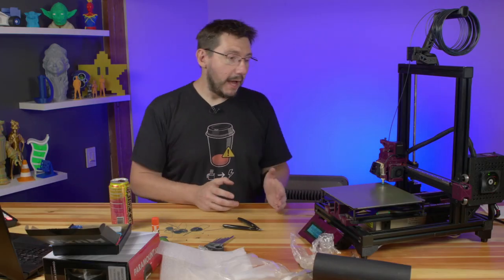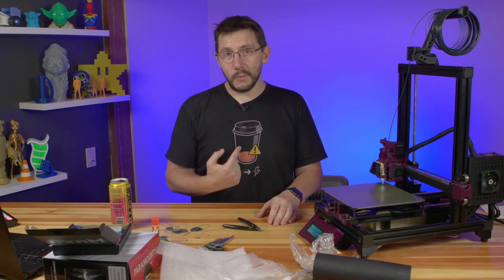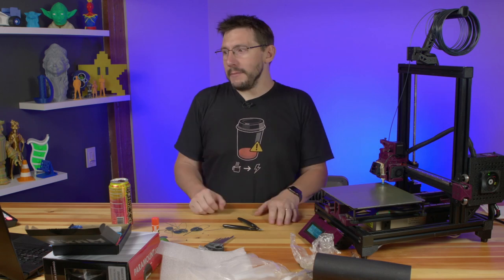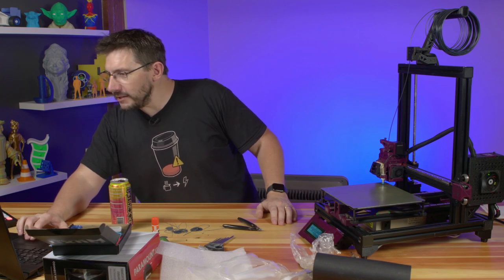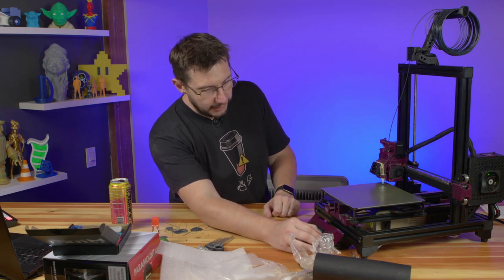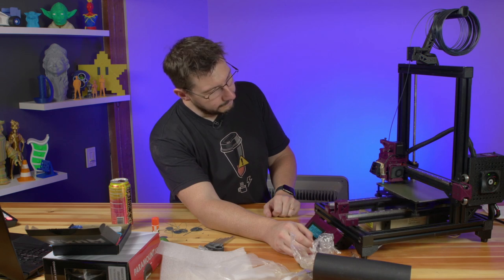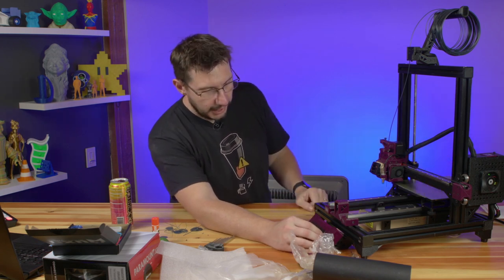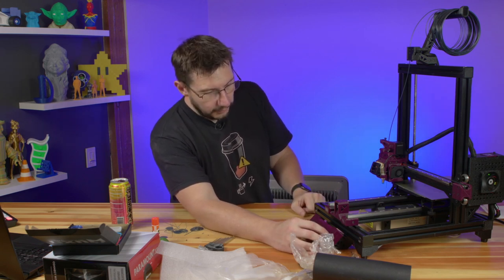It's heating, whatever. At this point though, getting the heights dialed in, totally me, right? That was totally my fault. If we can assign blame anywhere, I don't think there's blame to be had here. But if we could assign blame, that'd be on me. Trevor Ward, $2. Double check the x-axis is parallel to the frame or bed. That's a great idea. I didn't even think about that, but okay. Oh no, motors are still energized. That's okay. And actually, thanks for the $2 for that. That is a wonderful, wonderful idea.